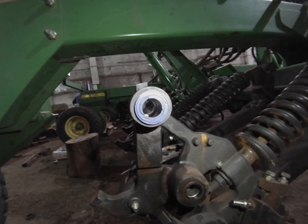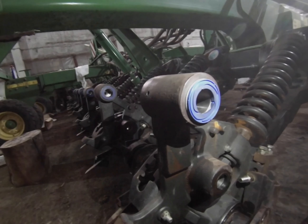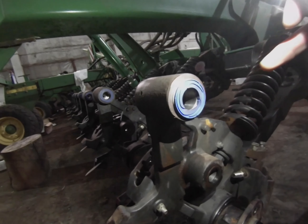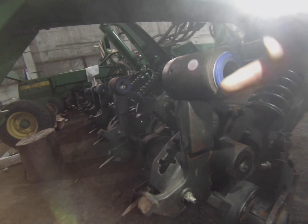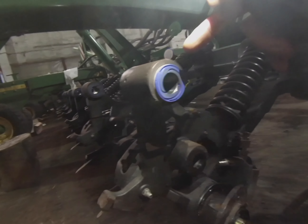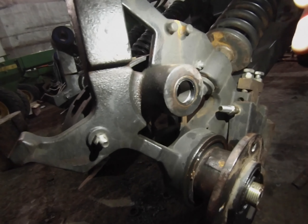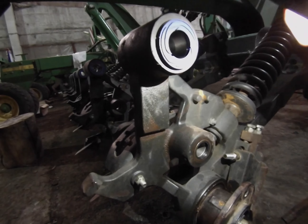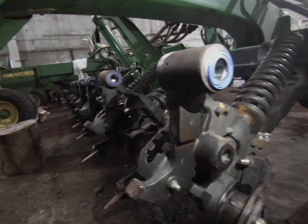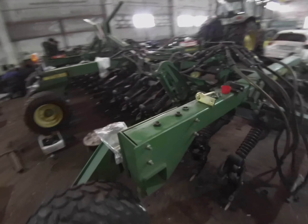Here's our ProSeal pivot kit. We actually put hardened steel bushings in and this face seal. The grease has to go in the cavity of course, but then it comes out these grooves, and the dirt would also have to go in these grooves to get in. So you've not only got a seal here - the original John Deere seal is here and that's a triple lip. This one seals not only along the pin but also the face. They're actually a grease-once-a-season pivot instead of greasing every other day just to keep it free.